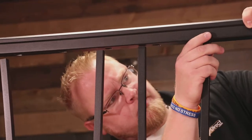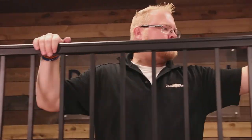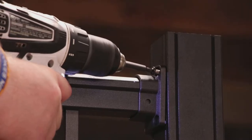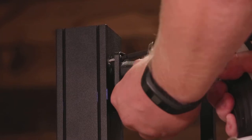With brackets placed on the top rail, start at one end and fit each baluster into its corresponding space. Lightly tap the top rail by hand or with a rubber mallet to ensure a full connection. Attach the top rail brackets to the posts, then secure the top rail in place through the brackets.